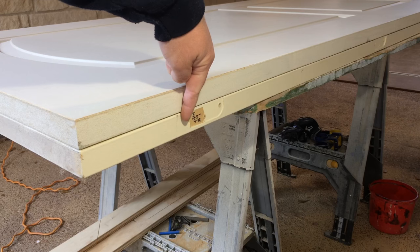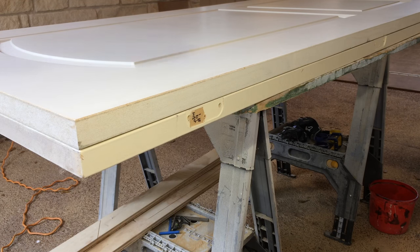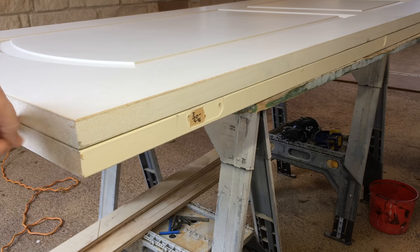When you're replacing a door, always align the top edge with the top edge of the old door to make sure you get your hinges right. The bottom of a door is made to be trimmed to allow a ventilation gap and for those odd cases where the door rubs on the bottom. So don't be surprised if the door you buy is a half inch to an inch longer than the door you're replacing.